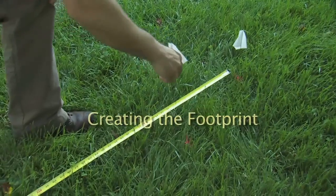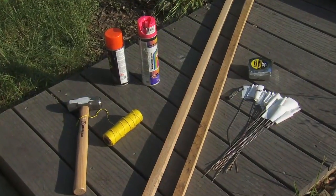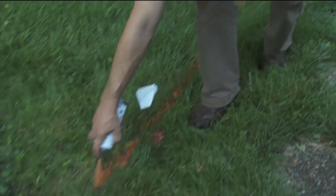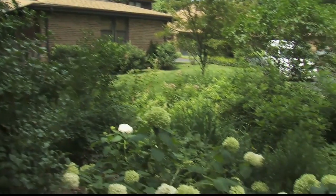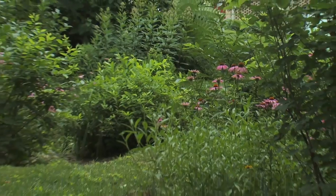With your design in hand, you're ready to create your rain garden. The next step is to start marking the perimeters of the garden using flags, stakes, string, a line level, a mallet, and paint — with those tools you'll put a good outline in the garden. We are constructing this rain garden in the side of this residential yard to slow down water coming out of the gutter, which was causing a muddy flooding problem in the backyard and flowing off to adjoining properties. We're bringing it through the gutter system into the front and side yard, where it will be absorbed by the rain garden and slowly disperse into the side yard and grass.